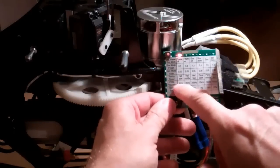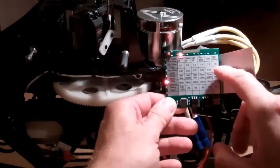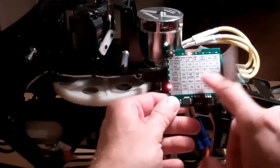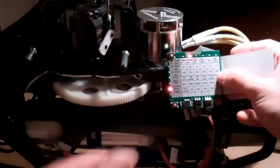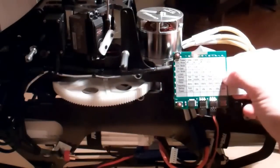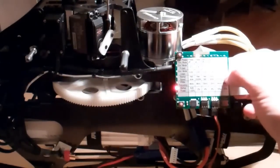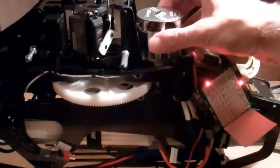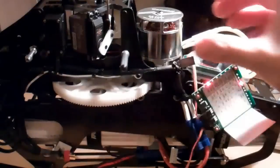And again, for my motor, I used the 8 kilohertz. And for power startup, it's 2%. So these are the settings on the YGE programming card, or in this case the YEP programming card, which seem to work very well for the Compass 510 kV motor, the rather large and imposing SZ4926.